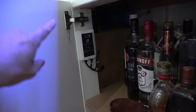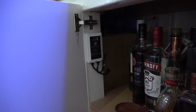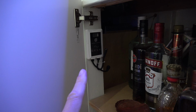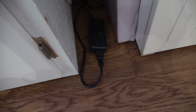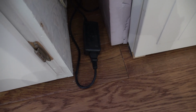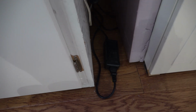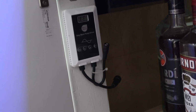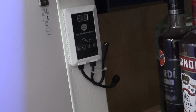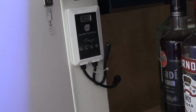Oh, I wonder if this controller prefers to have alternating DC current. Because when it switches over to the battery, the battery is DC current straight, not alternating. But the power supply here is taking AC at 60 hertz and converting it to DC. But a lot of times that DC is alternating, meaning it's not really alternating, it's pulse. It turns into like a pulse DC, so it's on, off, on, off. It could be that this controller does not like the straight DC, because 24 volts is 24 volts until you alternate it or pulse it. It perhaps does not like the pulse DC. The only thing I can think of. Let me know. It's kind of a mystery to me what you guys think that could possibly be.